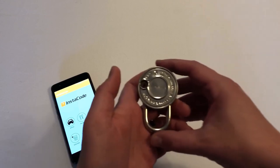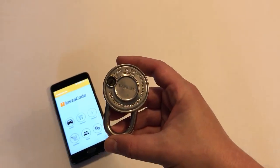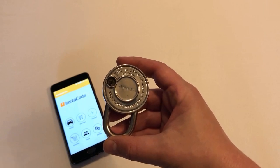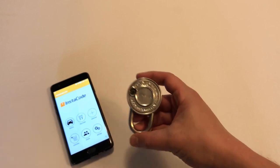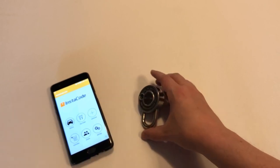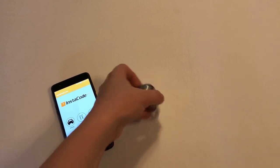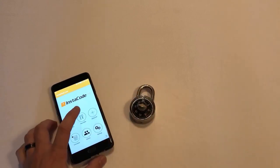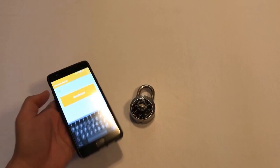Now, what is this? If we look at the back of this lock here, we've got some numbers and so forth. Is this the model of the lock or something? Well, not exactly. This number, 879065, that is an example of what's known as a blind code. A blind code is not the combination or the key bidding that would allow you to open the lock, but it does allow you to look something up in a resource that a locksmith might have.